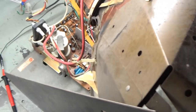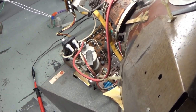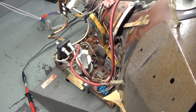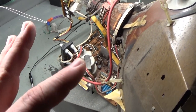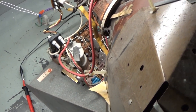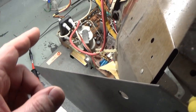We have vertical collapse, and it's usually only one of two or three different things, so it should be fairly easy to troubleshoot and find out. This also has the curl mod done to it, where you move some capacitors around and put a capacitor in another spot — I talked about the curl mod in the video previous to this one. So all we're going to do to this one is do a nice reflow, replace the B plus pot, get it to 120, and try to fix the vertical collapse.